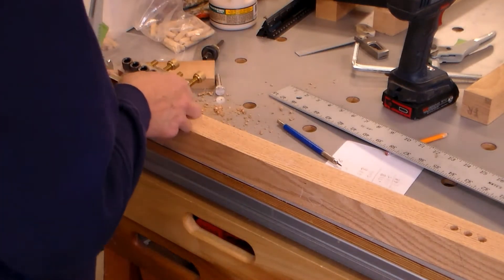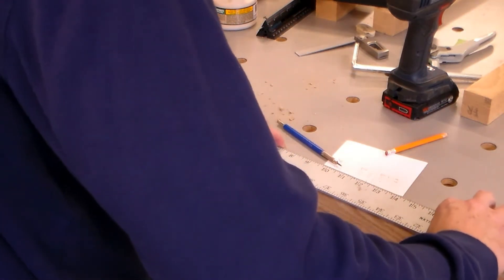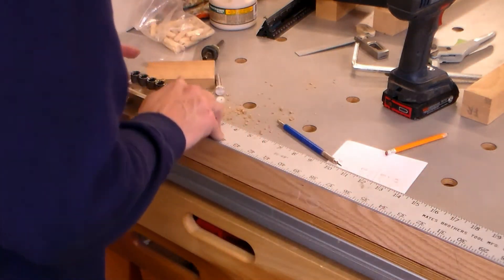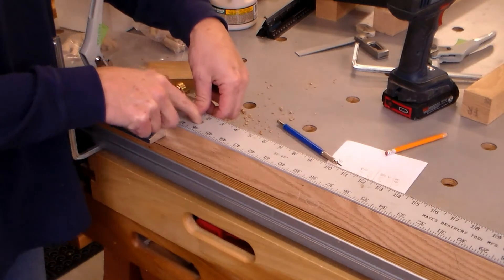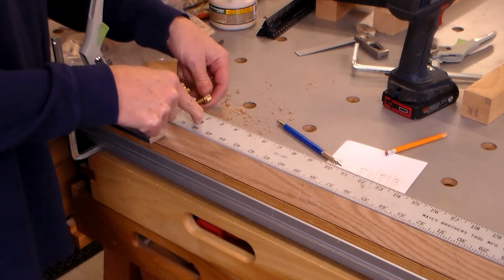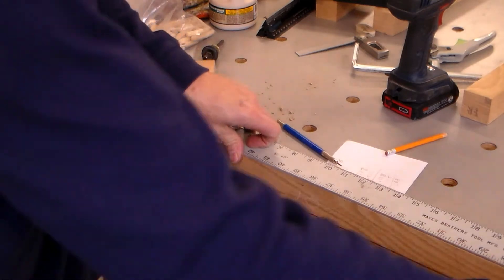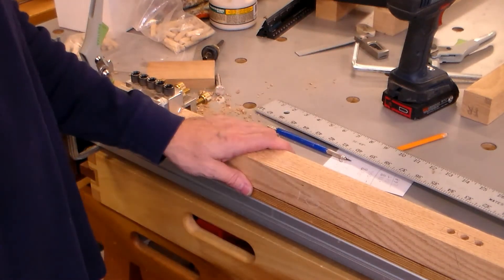Check marks on this side this time. I can put my finger in the hanging hole on this tool and pinch the jig together with my thumb to make sure it doesn't move on me — which works out really well for getting a good registration. I'll drill these three holes and then just repeat on the other three legs.